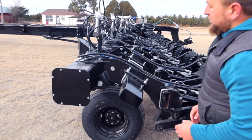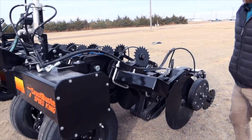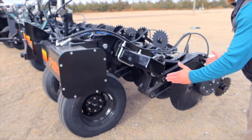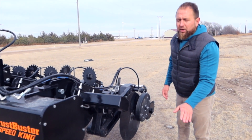This telescoping wheel assembly at 30 degrees is perpendicular to your 4x7 mounting bar for your opener, and this accomplishes two things: it gives you strong triangular support all the way from the base of your wheels to your opener, and it keeps this distance narrow, allowing you to contour up and over a terrace.